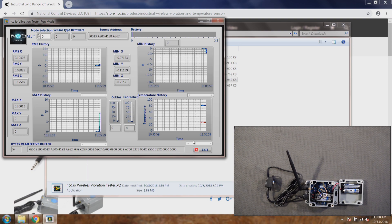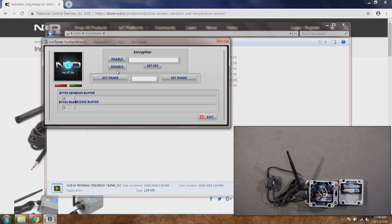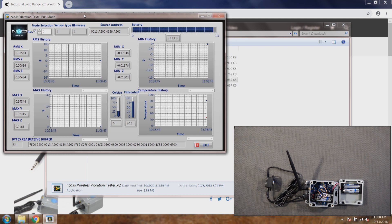Click on exit. If you want to stay on 7ABC, you need to go and configure the router and change its PAN ID to 7ABC as well. By default the router is 7FFF, so now I'll change it to 7ABC and click Set PAN ID. The red indicator means it's set correctly. Click exit and click run — you will see the data is now appearing on the UI because the sensor and router are both on the same network. This is the most common reason why they are not talking to each other.